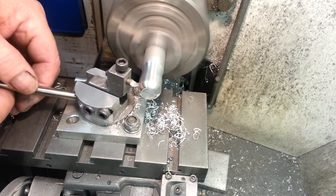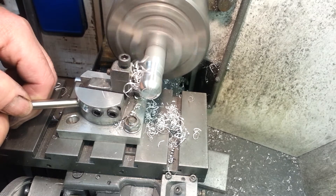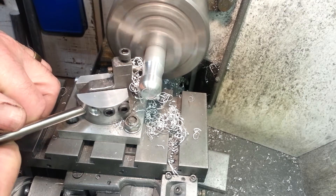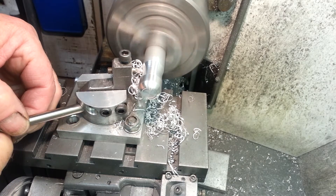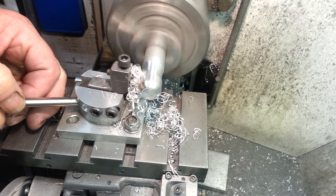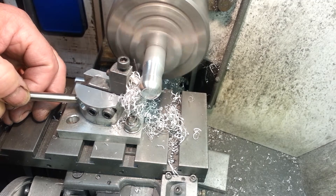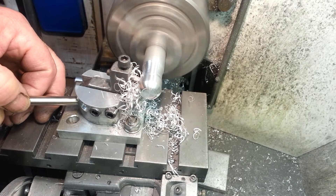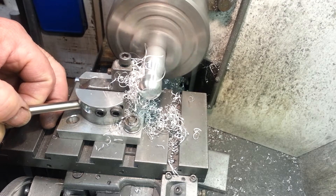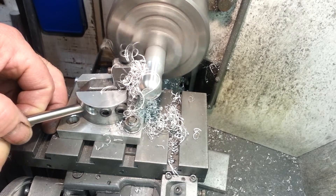I don't think I want to go much past where I am now. It's got a little bit rough there. It's still quite new so it's actually still bedding in. There's probably loads of swarf underneath it. I squirted a little bit of WD-40 on, which is not really a good idea because there's very little lubricant in WD-40. I'll take it apart and oil it later on.